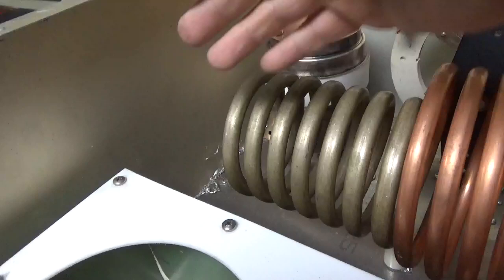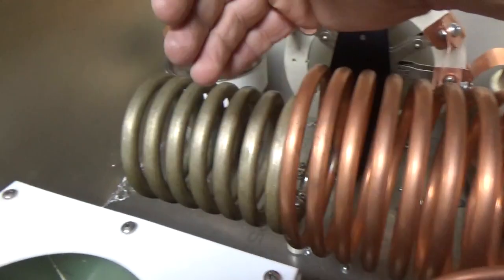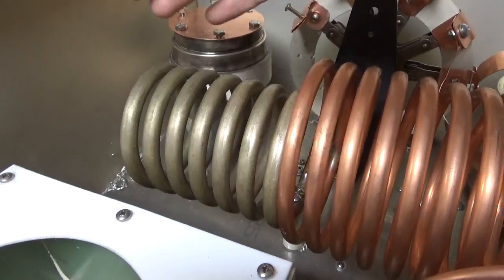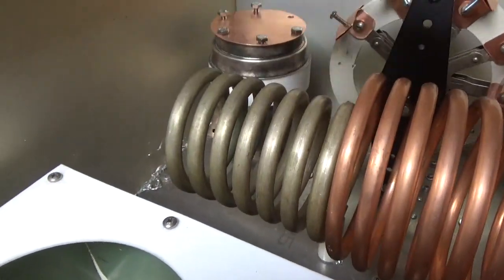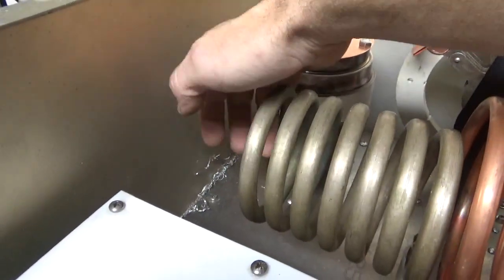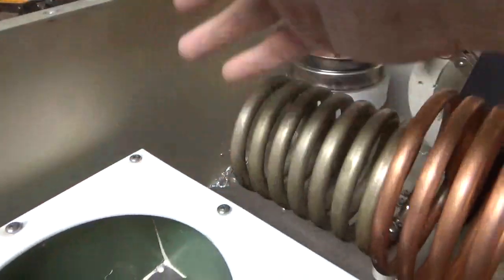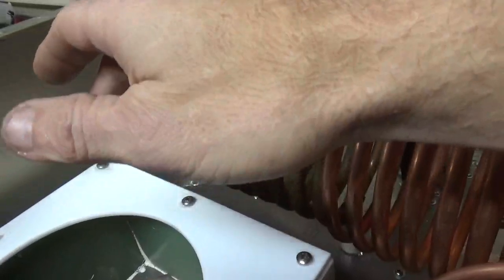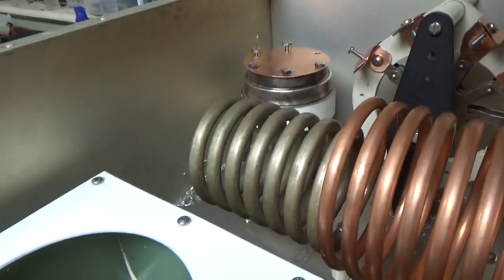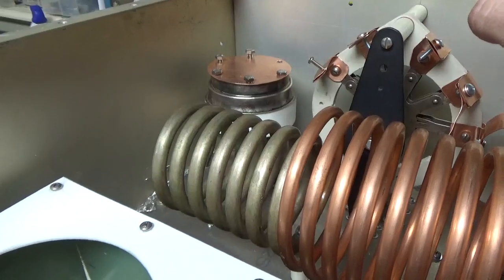I'm going to have to add some more inductance over here — some of this is the pre-inductor, so I'm going to have to add a little more. If I do, it'll just be a strap coil between here and the plate blocker. In order to figure out what I have, I'm going to have to work my way backwards with my inductance meter. It should be pretty much dead nuts on. I'll connect the plate blocker to the tube, put in the proper resonant load resistor, and just backfeed the output network to know where I'm at with the capacitor values.